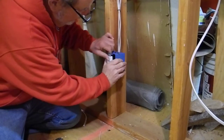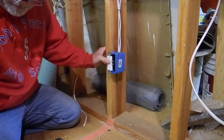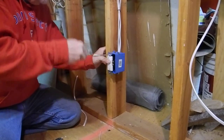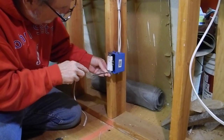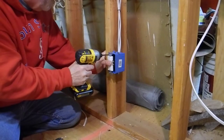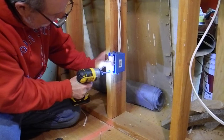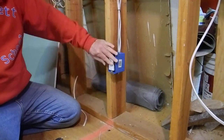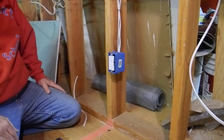So what you do is you kind of fold this back for a pretty installation. Of course when you do the final assembly, there'll be sheetrock on this. And we're going to put that there and get it started on one side, get it started on the other side. Nowadays most people won't even bother with that. And there you go — that's the receptacle. You kind of square that up when you have sheetrock so you can see it. And we're done.